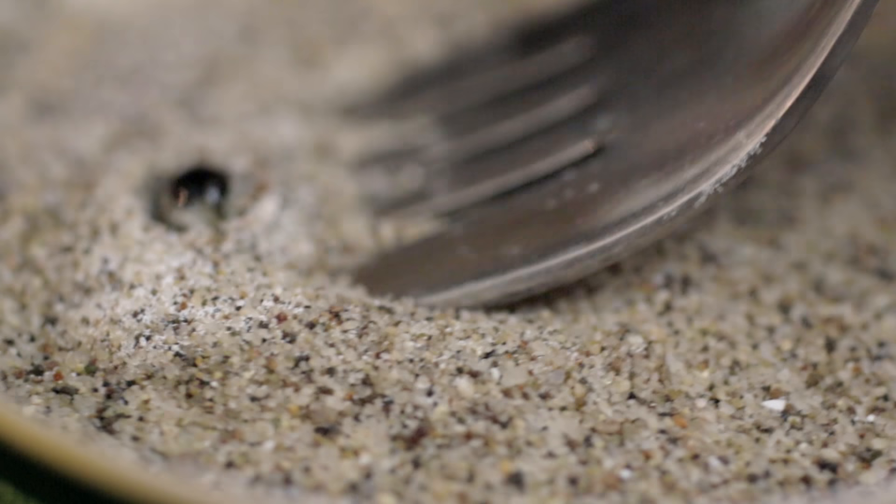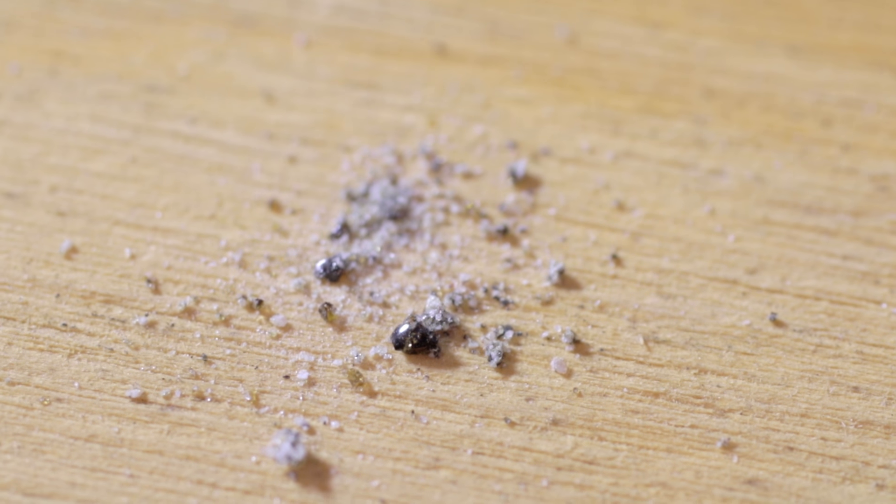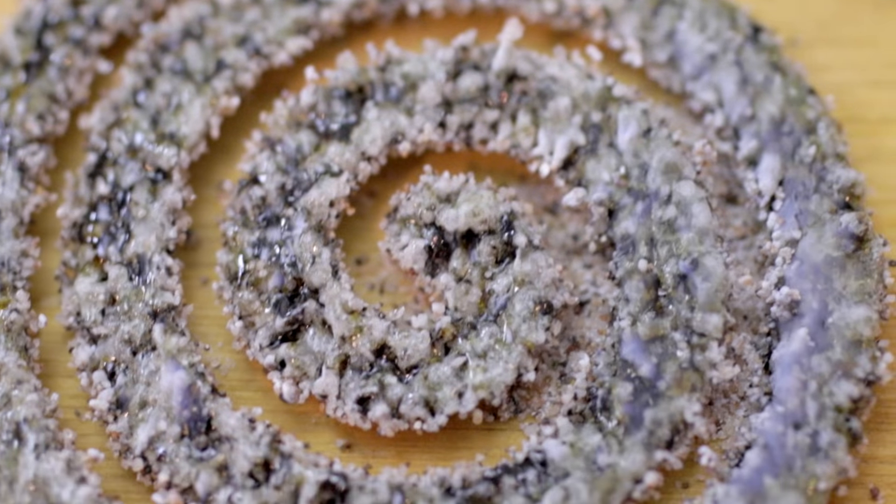This is working so much better than it was. We need to smash this one with a hammer — it's hammer time. Oh, where did it go? Everywhere. Turns out laser smelting beach sand into glass works really well. They're not super strong, but I'd be surprised if it was. We ended up smelting a circle, a star, a lightning bolt, a giant spiral, and a flying spaghetti monster. What was wrong with the laser was the grounding wire from the end of the laser tube came undone from the power supply — terrifying, because the power supply is about 25,000 volts. It was literally arcing out of the jumper wire into the frame of the laser, which is grounded.